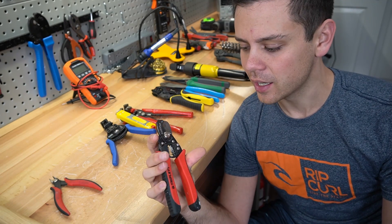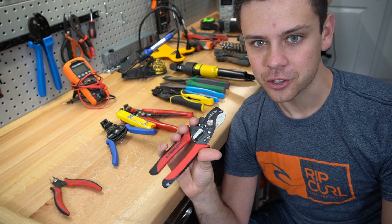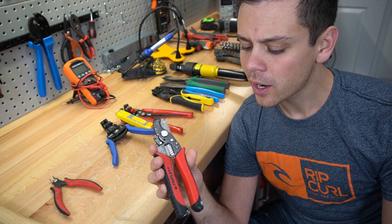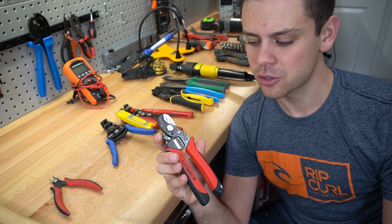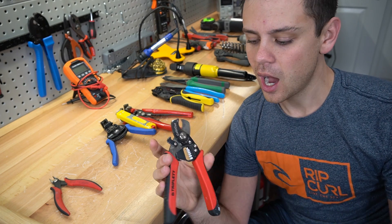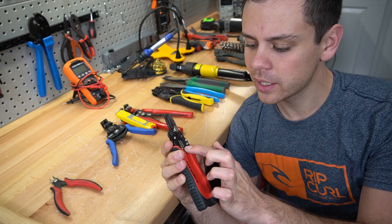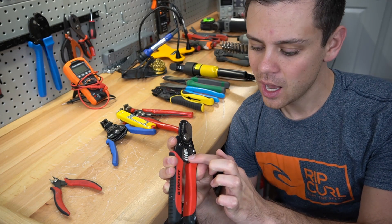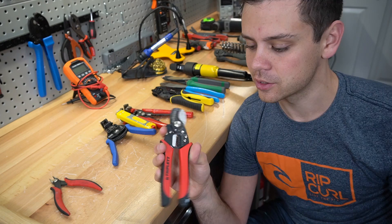The first tool is the cable cutter. I use this every day for small and large wires. At first I thought I could only use it for small wires, but I use it up to about two or even zero gauge wire. I would not use the stripper on it unless it's a solid core conductor — I do not like it for stranded. I don't use that stripper at all because there are better options.